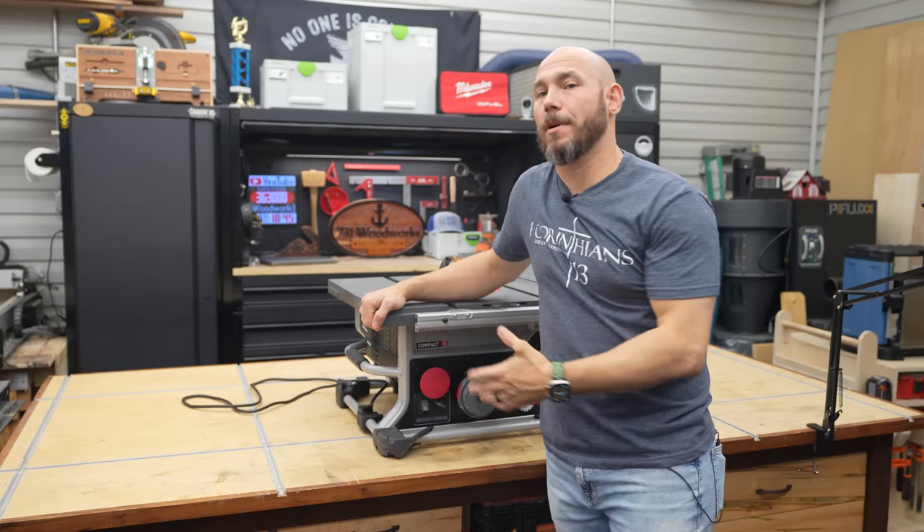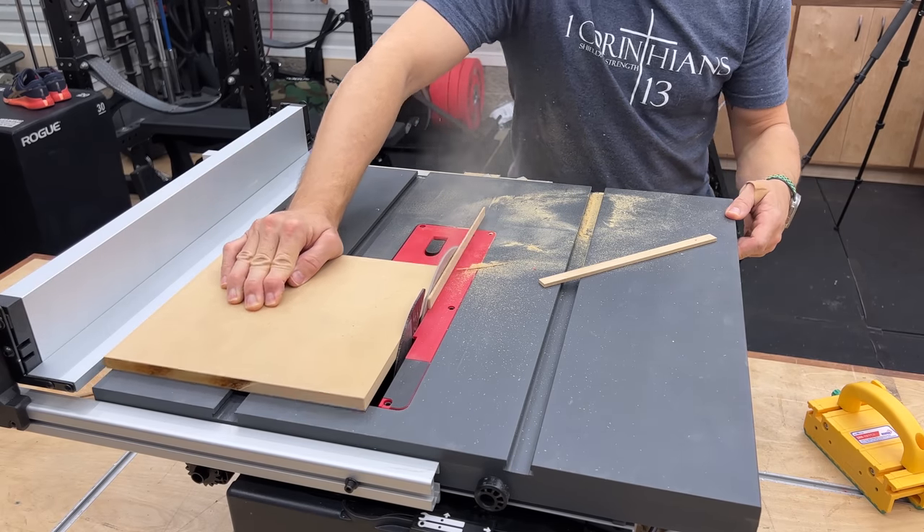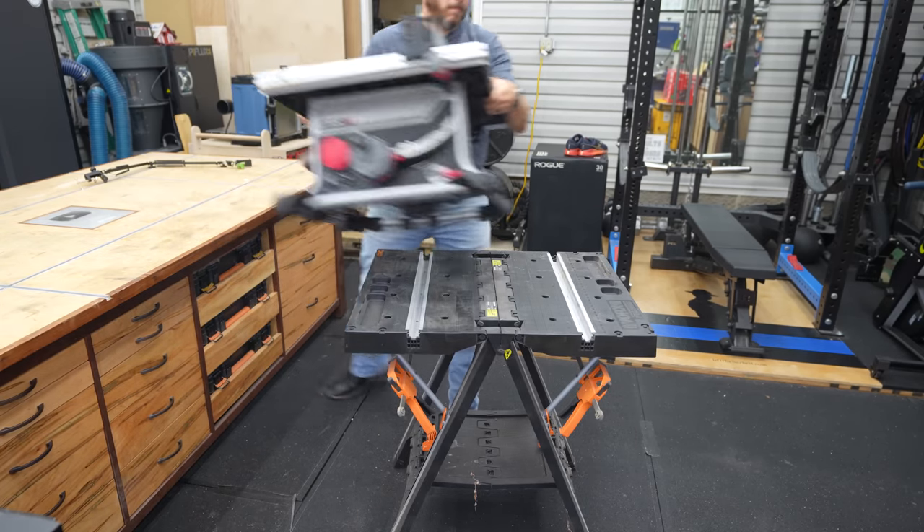I really like how fast you can adjust the angle or the miter cuts on this saw. You pull on the handle and it moves with ease to whatever angle you need, all the way up to 47° or back to negative 2°. You can also micro-adjust the angle simply by turning the dial, which I really like because you can really dial in those fine cuts. SawStop includes a zero clearance throat plate, which means you're going to get a cleaner cut on most all your woods — plywood, hardwoods, softwoods — because you have less tear-out on the bottom. The saw is also heavy enough that it doesn't move around on the workbench while you're cutting, mainly because of these non-slip rubber feet.